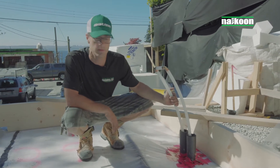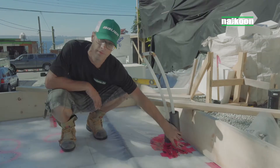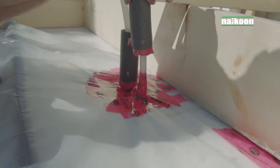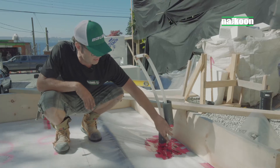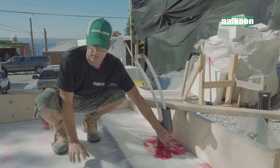These are our water pipes for our outdoor shower unit, which is actually going to be setting out here. We have about an inch and a quarter of an elastic sleeve that comes up, which we then foamed, caulked, and taped, and then re-taped again with a tuck tape to create our seal with our poly.